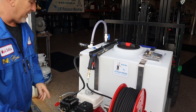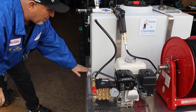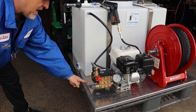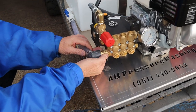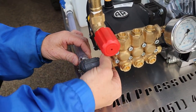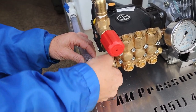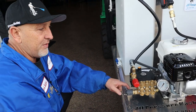You'll want to come over here and put water in your tank above the pump. With the water in the tank, you'll have an air pocket here. You literally loosen this with your fingers, and as water starts dripping, you tighten it back up with your fingers. And that's how you prime your pump — you want to get this air pocket out of your hose.